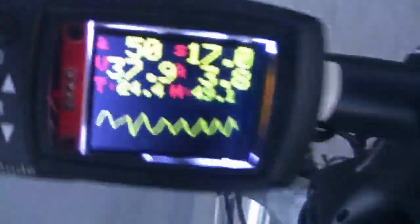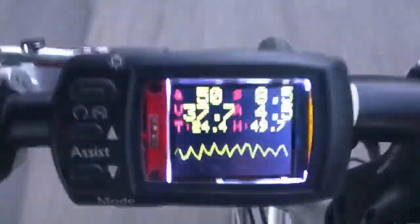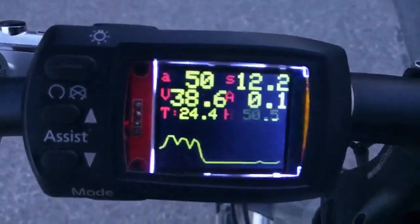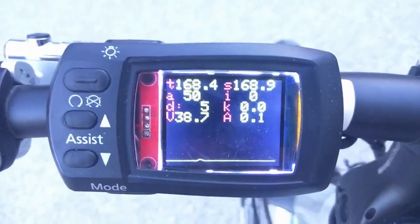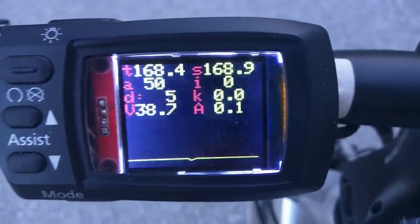Now on the street with no pedal — let's do some driving. You can see the pedaling being detected. I'll put a bit of brake on so the motor needs more power. You can see pedaling is easily detected. In developer mode you can see the torque in the upper left and the stop torque to the right. If I put a bit of pressure — yeah, that's really safe.